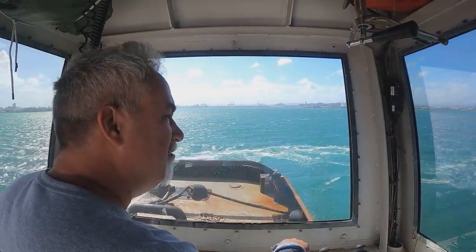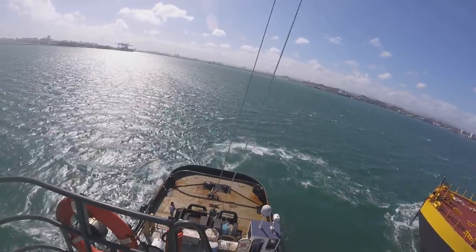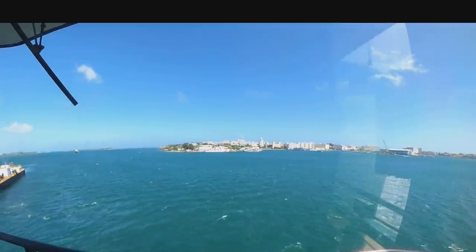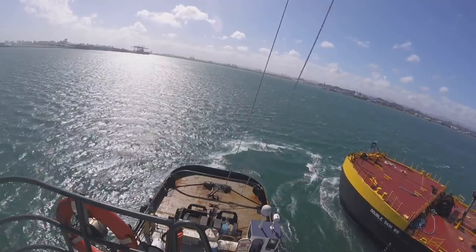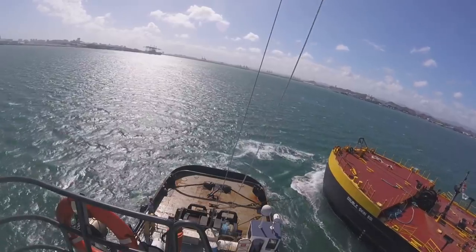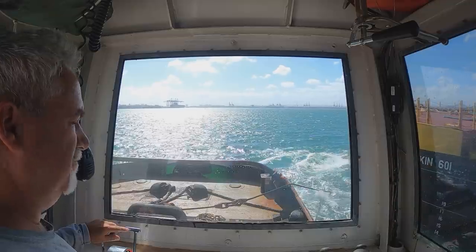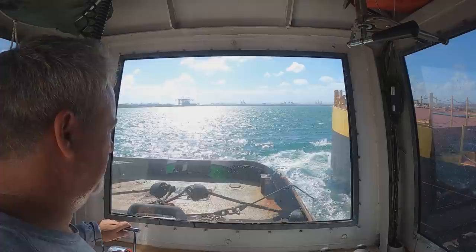You have to stay as close to the barge as you can, but you don't want to get run over by the barge at the same time. Right here we've got basically perfect conditions. The wind is blowing, but it doesn't really matter because the barge is loaded — most of the barge is underwater right now, so the part affected by the wind doesn't really matter given how much the barge weighs. Right now I'm sucking in on the winch, slowly bringing us around. When we get done, we'll be what we call heads and tails. There's a picture of what I'm actually seeing. You can see we're still making way on the barge.